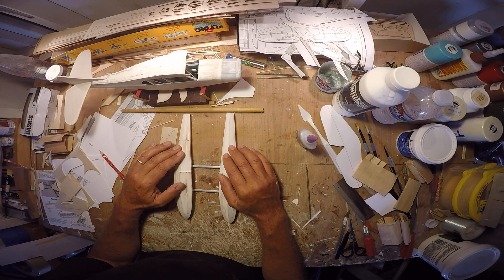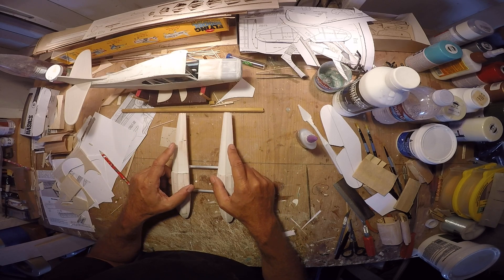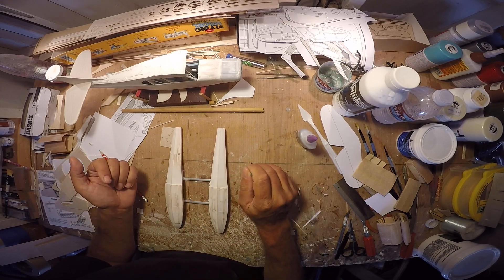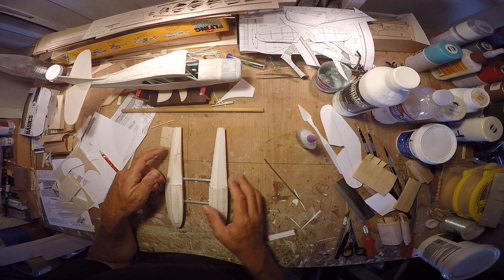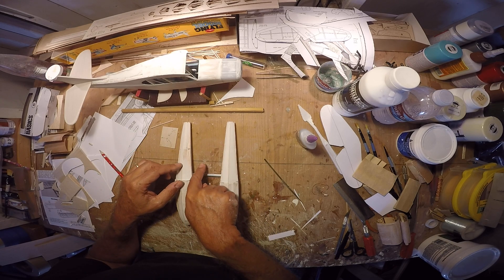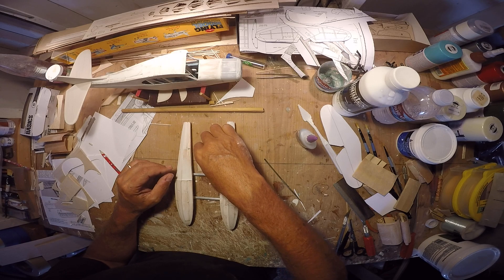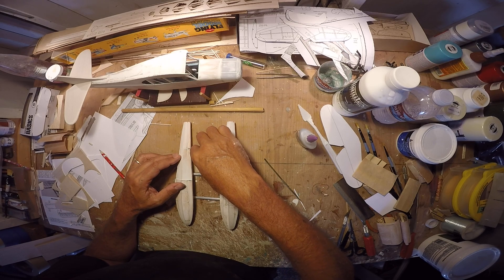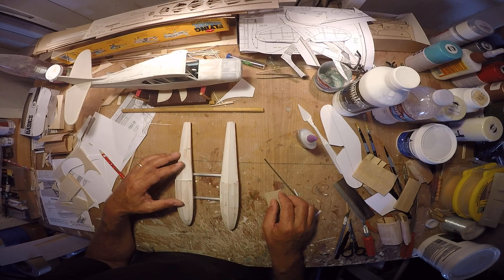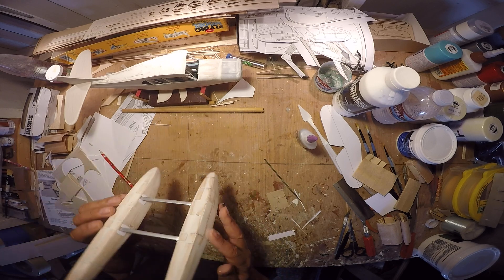The floats are flat down their length, so you've already got them flat. Then you just need to make them square. And that's where the shipwright cross — or just the right angle that I draw on my desktop — comes into play. So you're going to center one of the floats, make this a 90-degree angle. Straight line, consistent. And you've got flat, square float assembly.